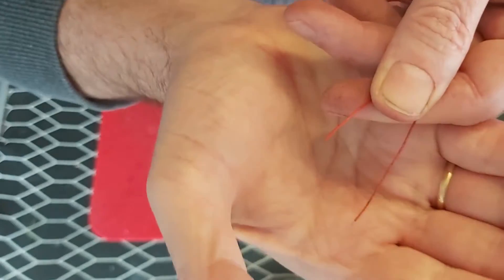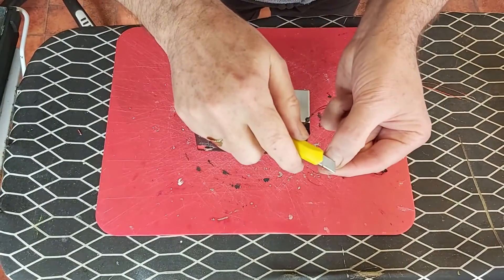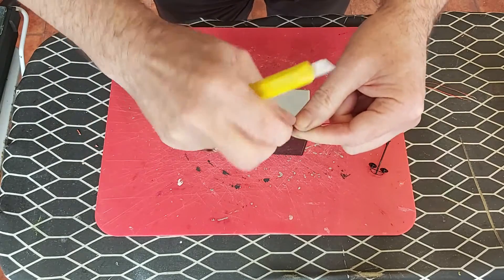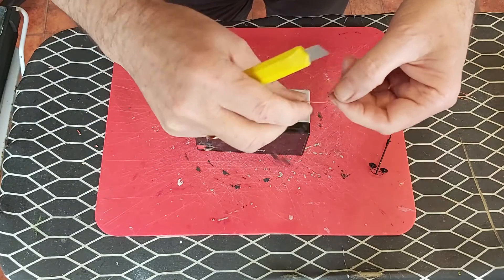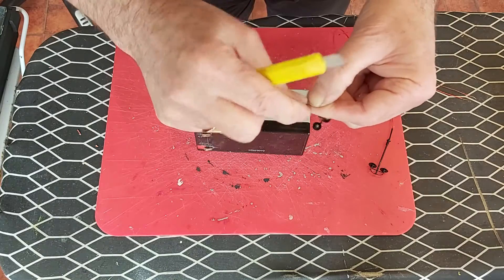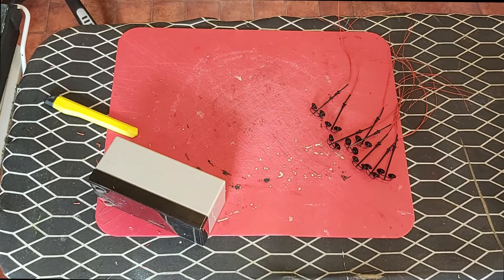My concern is having the wires reach, because some of these are going to need baring back. I can pre-solder them — just watch your fingers when you do this. I don't have one of those fancy wire strippers, or if I do I don't know where it is and I really don't want to dismantle the house to find it. So just shaving off the insulation to about one centimetre. The intention is to solder them all up, then join them together and put some heat shrink over them to make everything nice and safe.